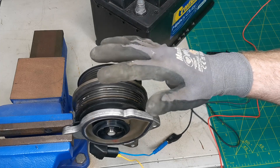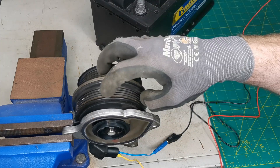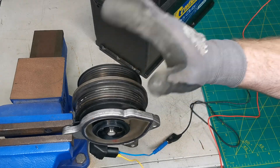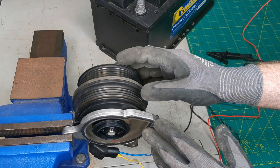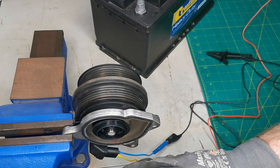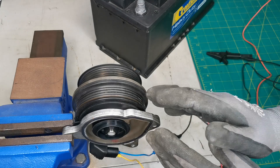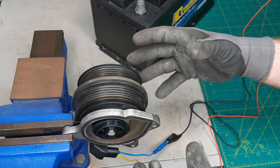And that is how your supercharger functions on this design. On this Volkswagen twin-charge system you have your supercharger and your turbo. When the supercharger becomes active, it's commanded on and the magnet engages — that's how it functions. A couple of things to consider when replacing this item: this isn't just related to the cooling side, it's also related to the performance side. On this vehicle, I had the groaning noise that was heard at idle.